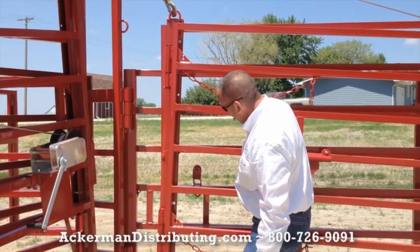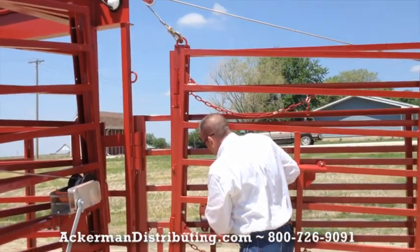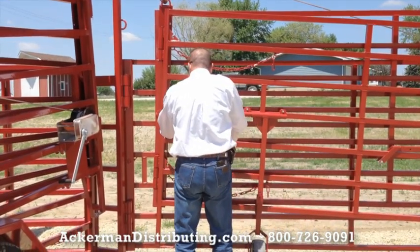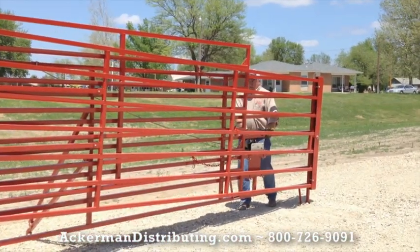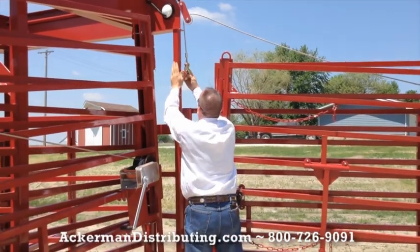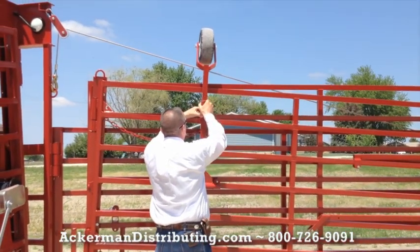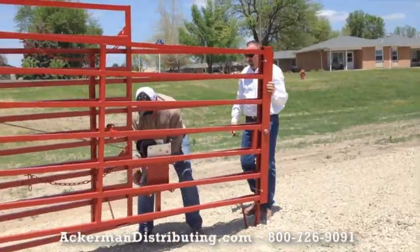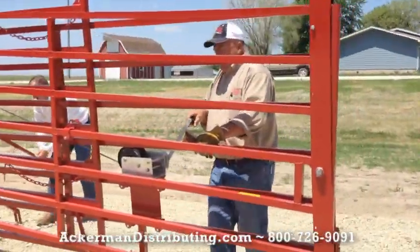This is a heavier winch and cable that they put on the Senior versus the standard OK Corral. You just set it on the panel that's marked 'Fasten Here' — there'll be a yellow sticker. Then you re-hook it to the main frame of the corral to swing in the three panels. Lift your panel wheel up and attach it back to the panel. This is a double-sided winch, so you don't have to worry about it freewheeling — it has gears in both directions. It's a lot safer.